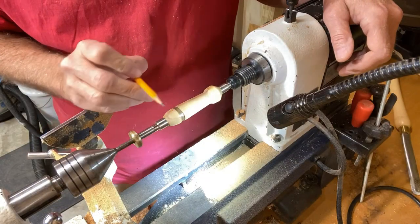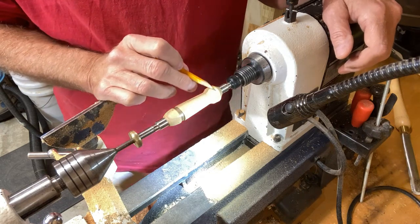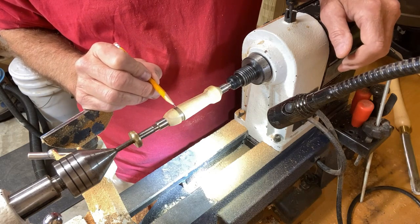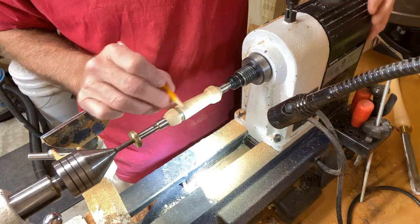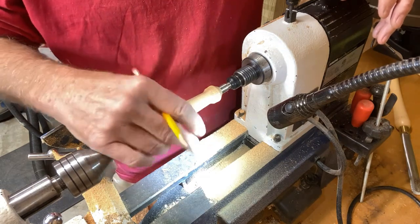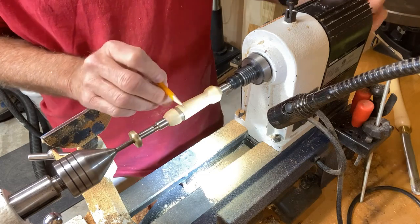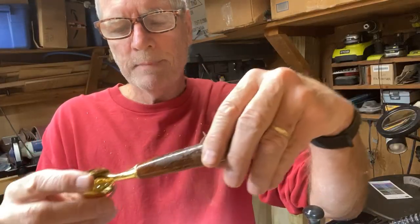I like the shape of the handle now. I reduced the tail end by about 20 percent, gradually narrowing down to about a half inch at the head, with a subtle lip that flows back down to the bushing. At the back, I made about a three-sixteenth inch groove that I'll fill with black epoxy putty, sculpting it into the handle once it dries. I'll turn the other three handles very similarly, then show how to use the epoxy putty.